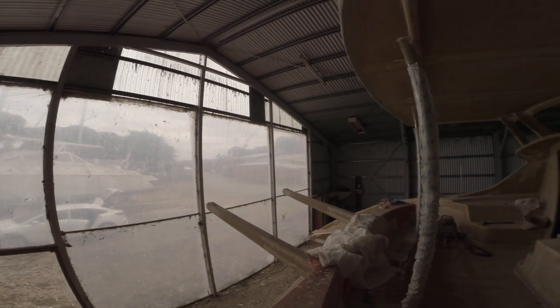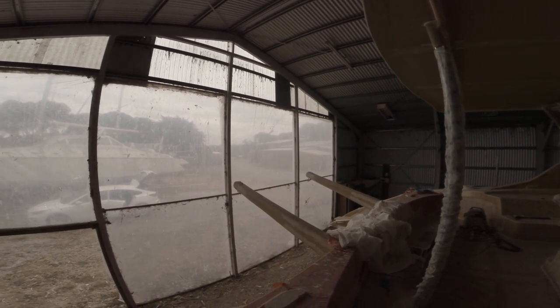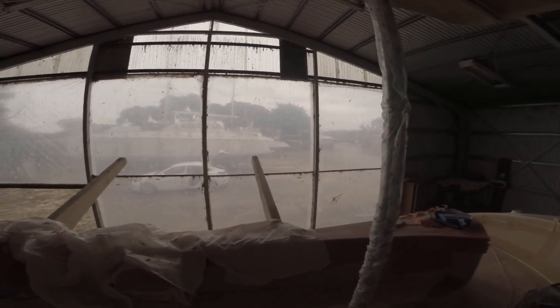Some sort of targa beam here for additional solar — five or six panels. I'm going to want 1500 watts if I can. I don't count on 1000 watts being delivered at any time because of shading from the sails.